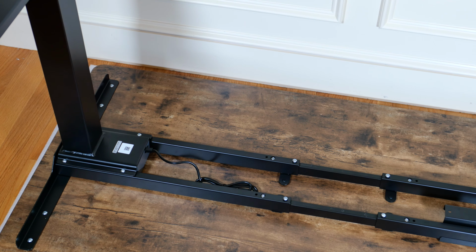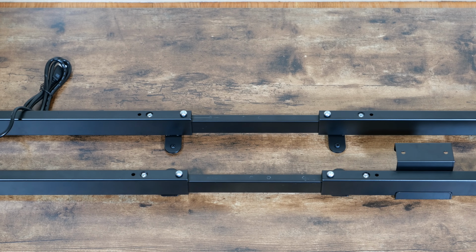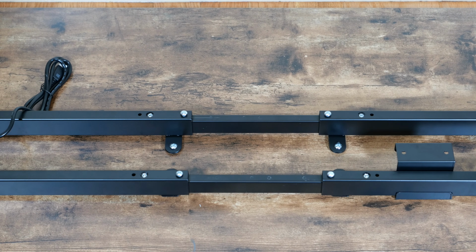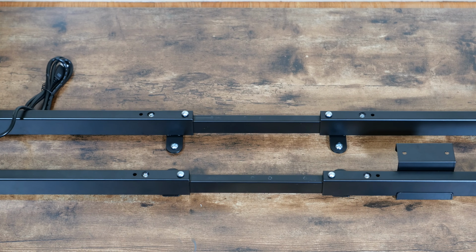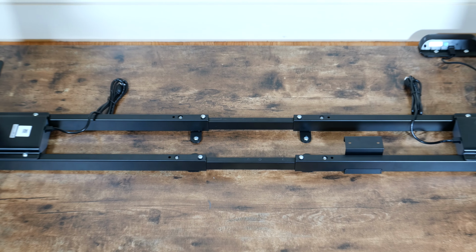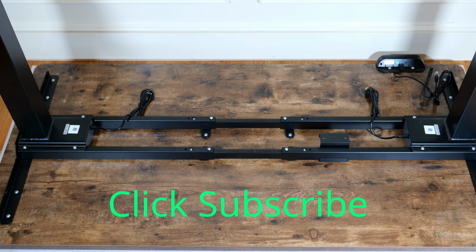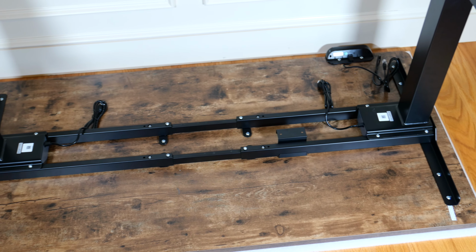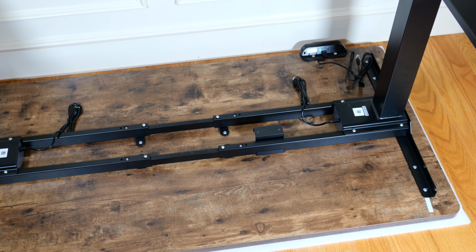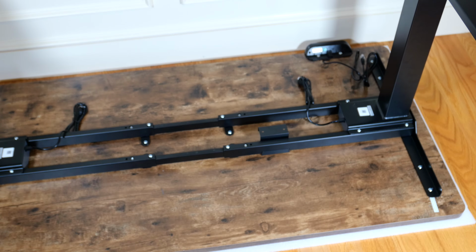And then once you're done with this, those screws that are in the center of the crossbars can be tightened down as well. And then you can insert the 4 screws where the rubber grommets are that mount the center of the brace to the desktop here. And at this point, the support structure should be fully bolted down and tightened to the top of the desk. And again, here you see I left that power supply bracket, which I ended up taking off later. So I don't recommend that you install that.